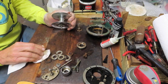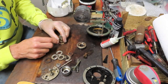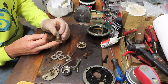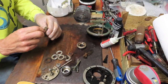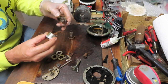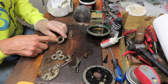We've got chrome pieces and metal flaking coming off from the corrosion - we'll see how pretty we can make it. I also removed the pinion gear sleeve. It's got a main gear on it with rust. That assembly should have just pulled off, but it was rusted in. Once I WD-40'd it, it separated pretty easily with rust underneath. So we'll want to clean that.